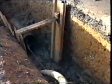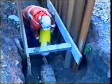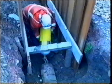A further closed-circuit TV survey is carried out after cleaning to ensure that all debris has been removed from the pipeline. A PE gauging pig must be used to check the uniformity of the pipeline bore and also highlight any internal abnormalities not evident from the CCTV survey. A gauging pig confirms the size of the die to be fitted to the swage lining rig.